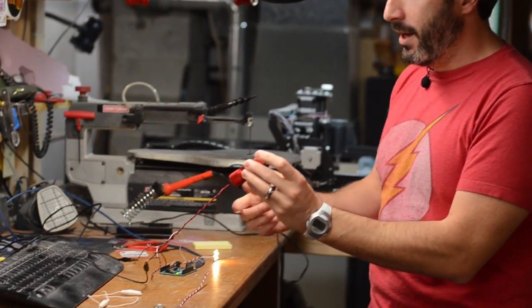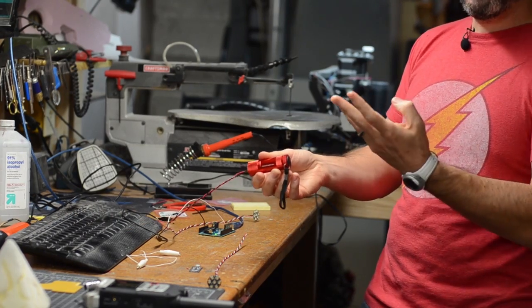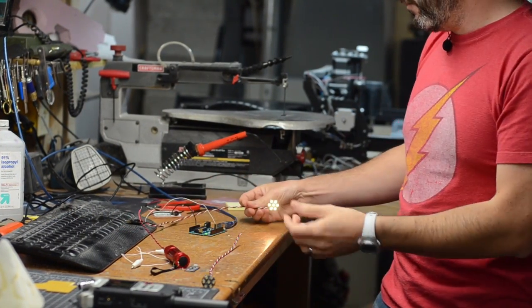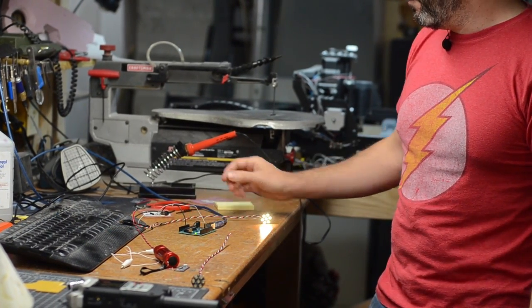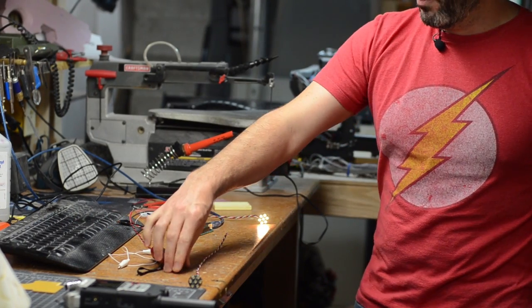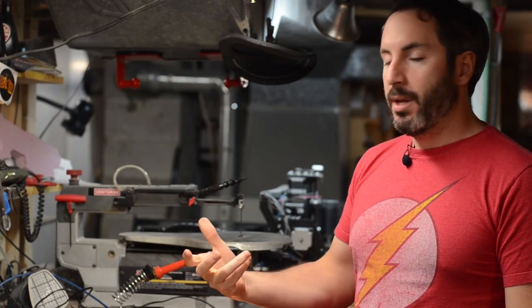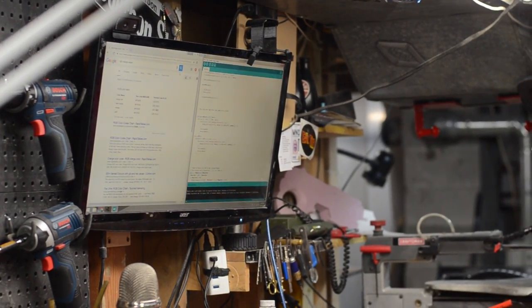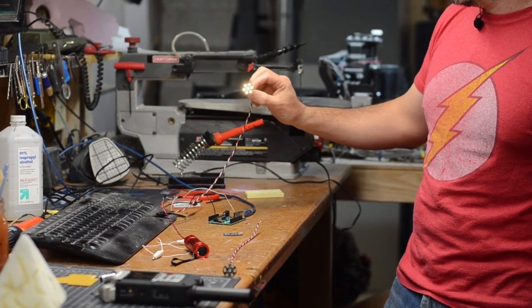So what we've done is we've taken a cheap flashlight that we can easily turn the power on and off. It's got three batteries - it'll supply 4.5 volts, which is really good for powering an Arduino and for powering our NeoPixels - it'll take up to 5 volts. What we've done is use the Uno for prototyping purposes. We'll move on to a Trinket Pro for actual incorporation into the prop. We've written code to pulse the light after initializing our NeoPixel Jewel. The code loops itself over and over again, dimming and brightening our lights.